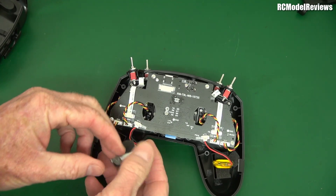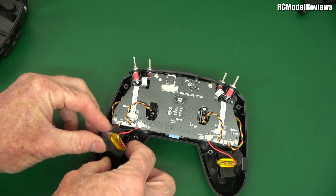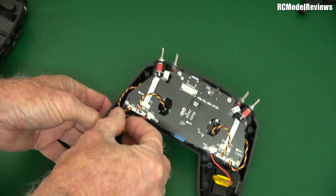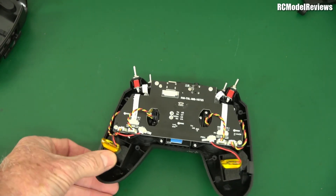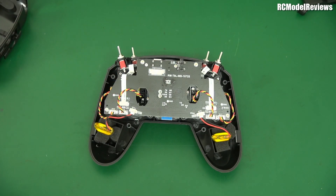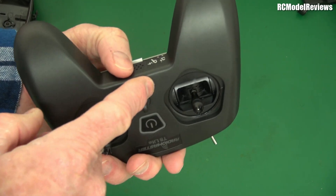Single 1S lithium polymer batteries — that's interesting. It's worth remembering that lithium polymer batteries don't like being left fully charged or fully discharged. If you're going to buy this radio, be careful about battery management. Don't charge it up and leave it fully charged for three or four weeks — those batteries may puff. Also if you run it fully flat, make sure you put a bit of charge in. Keep at least two bars on the little illuminated battery gauge on the front.